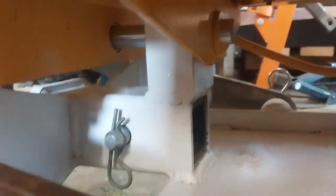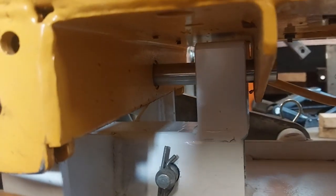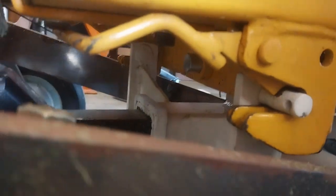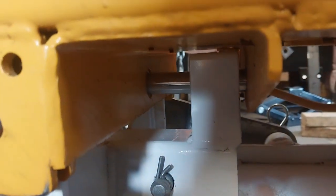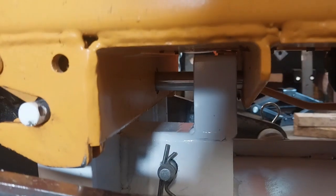When I put the receiver hitch in there, I did put some supports between the receiver hitch and those uprights for the pins, but it's still all that weight on the pin. So I wanted to have something a little bit stronger. This is the original pivot for the front axle. I got a block of metal, dug a three-quarter inch hole in it, and a three-quarter inch chrome shaft just goes through there. There's a set screw on the other side that tightens down and keeps it in place. That will equalize the load — it'll take all the weight off those pins and put it onto that shaft, which is much better.